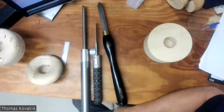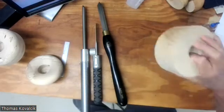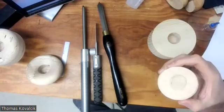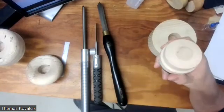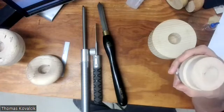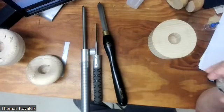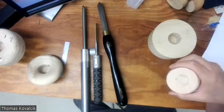So the waste block lasts a long time. Again, that's the reason why I make these things 2.5 inch, where I'm only going to use 2 1/8 inch final. You can do it the other way and cut away your waste blocks, but it takes you about 15-20 minutes to set up a new waste block. This way, if I cut my wood thicker in the beginning, I can make 20-25 pieces on one waste block. Again, it's more efficient. Wood is cheap for me. We all got wood sources everywhere. So I don't mind making blanks thicker than I really need. To me, it's worth it.